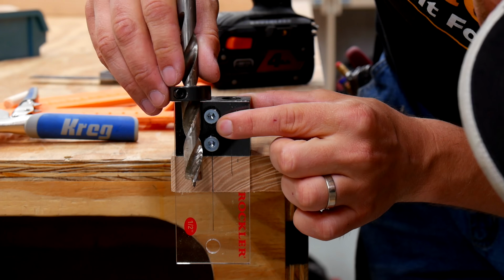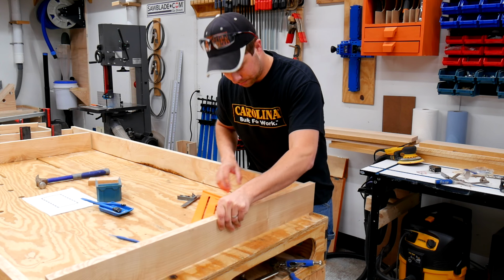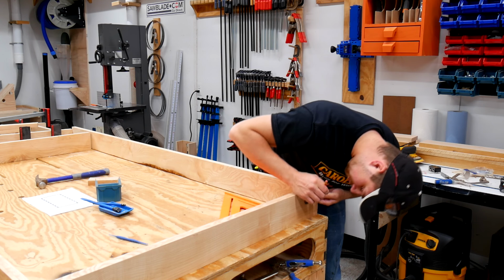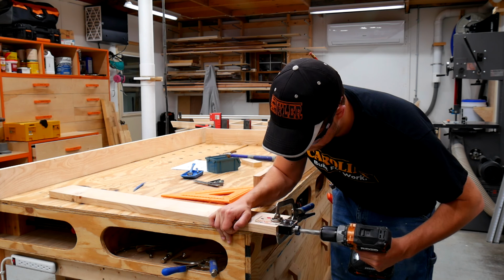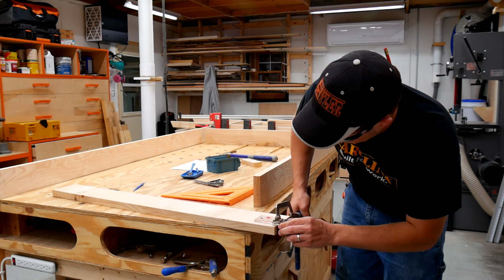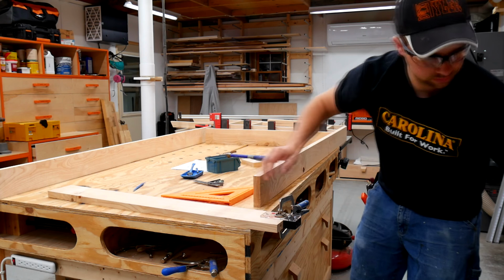And now it is time to move on to the assembly of the bed frame. Again, take note of the depth stop on your drill bit so that you don't drill through the slightly thinner walls of the bed frame. The sharpest of you might have noticed that I switched over to a brad point bit. At this point, it helps me get better directional control and straighter holes. There are 2 1/2 inch dowels in all corners of the bed frame.